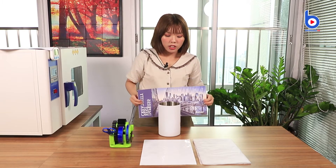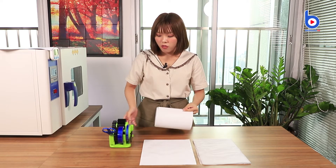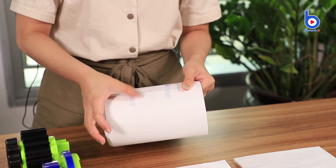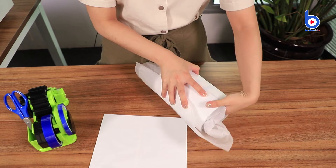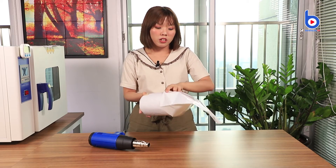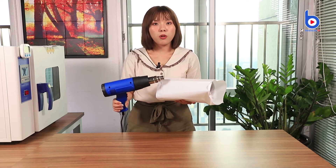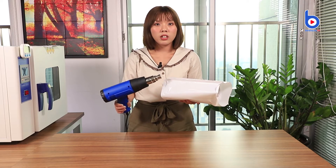This is my image. First, I need to wrap the wine cooler with the image and fix it with the thermal tape. Then I wrap it with a protective paper. Now I need to wrap the wine cooler with this shrink film. I need to put it into the film first, then I will use this heat blower gun to heat the film, and it will shrink to produce pressure and wrap the wine cooler very tightly.